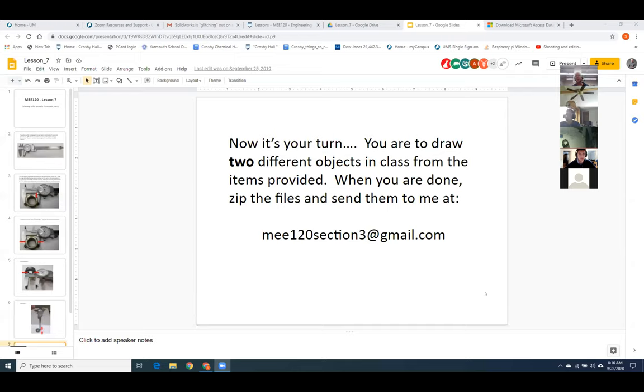Okay, so in the chat window, I put the link to the video on everything not to do in MEE 120. Everything that I'm going to absolutely go bonkers and nail you for on the test. So the big ones for me: no thread feature. Always cosmetic threads, whether it's male or female. No external sketches. Everything driving an extrude or a boss or a sweep or whatever should be under the feature, so that the reader's not trying to find the source of data for the object across multiple sketches. There's never a need for that.